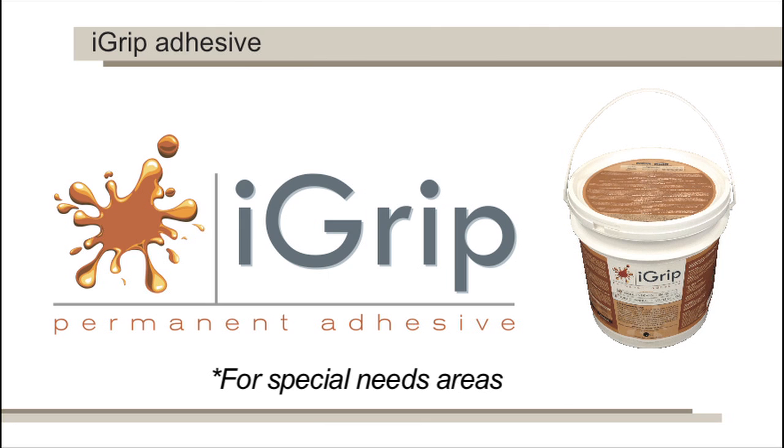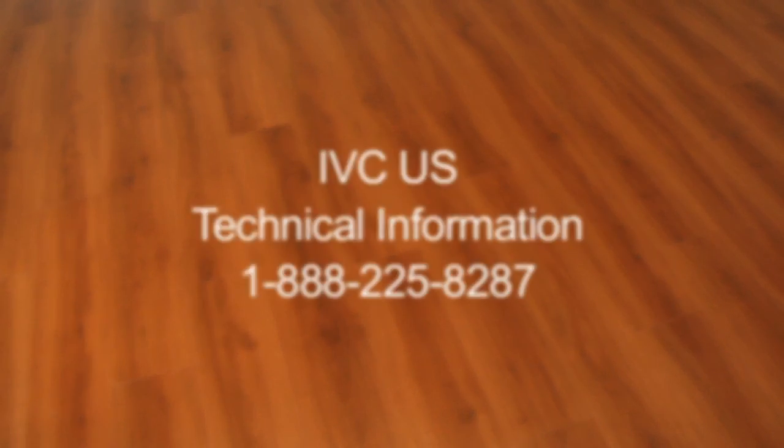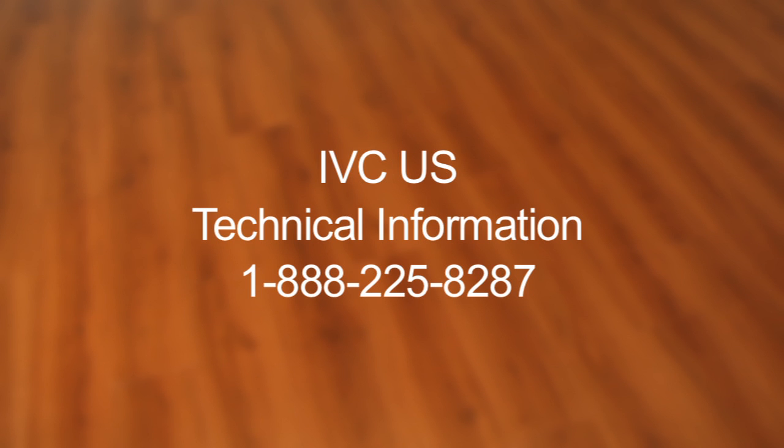If the installation of treads, risers, or wheelchair ramps is needed, the glue-down method should be used, using IVC US iGrip permanent adhesive. Apply the adhesive following the manufacturer's instructions. If you need additional assistance, call our technical information line at 1-888-225-8287.